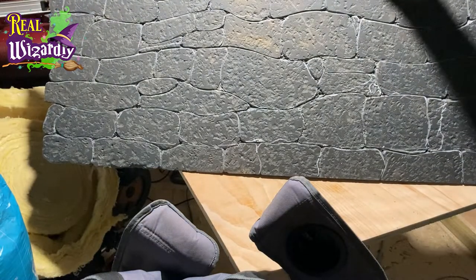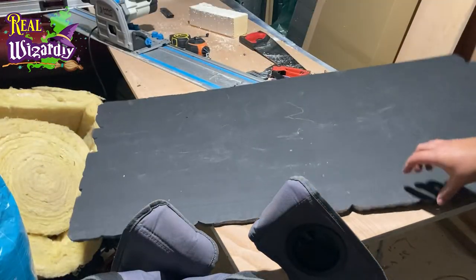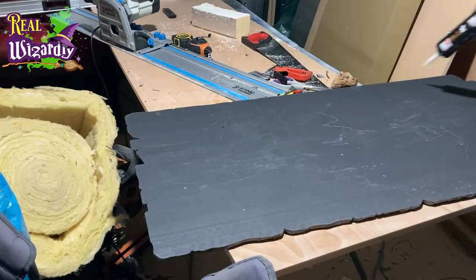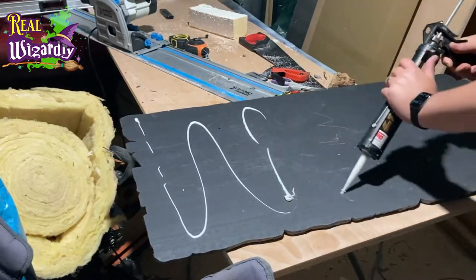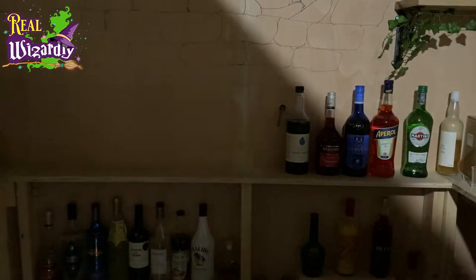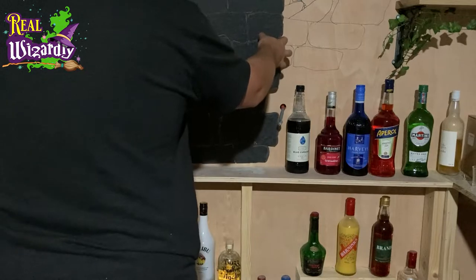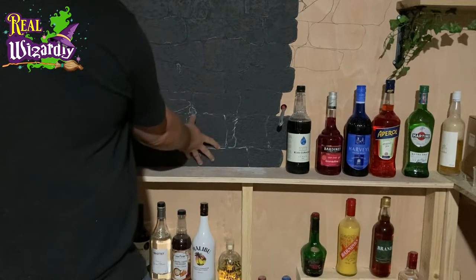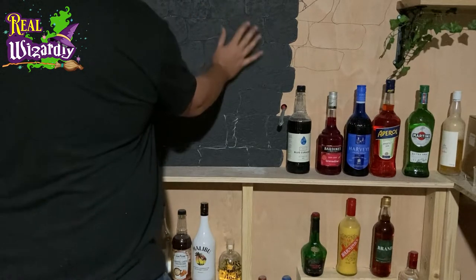Okay, so once it's all textured it's starting to look really good. All we have to do now is flip it over and use some no more nails on the back to stick it to the wall. I'll get out my caulking gun with some no more nails and just squirt it all over the back. This edge I've left deliberately flat because that's going to rest directly onto the bar, so I needed something fairly clean and flat on that. We need enough so that it sticks permanently but not so much that it ekes out the side. The good thing about no more nails is that you're not really committed until it goes off, so you do have a bit of play and can move it about. I'll also need to paint the wood so that all the grout lines look black.